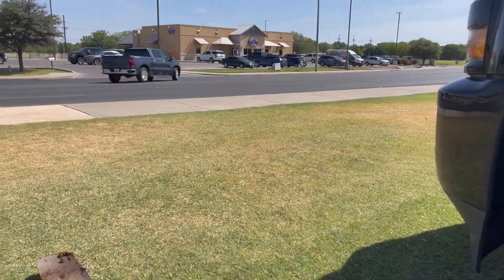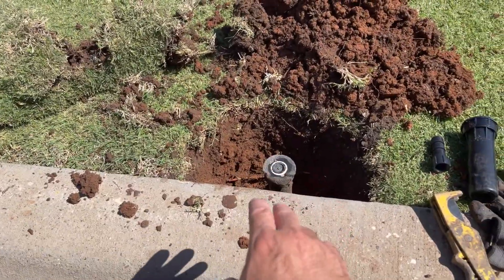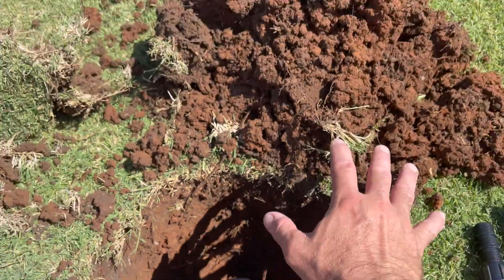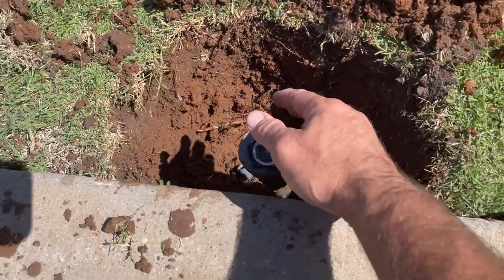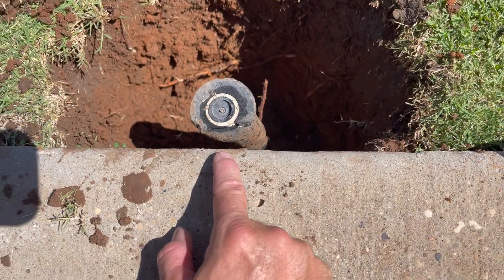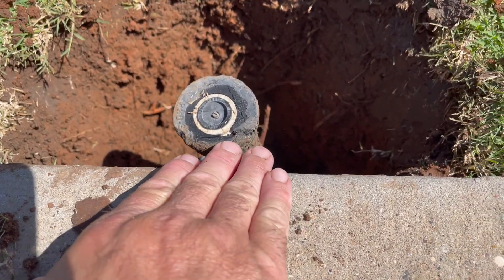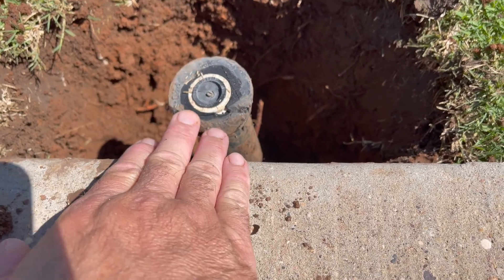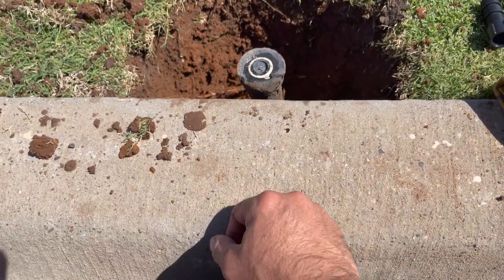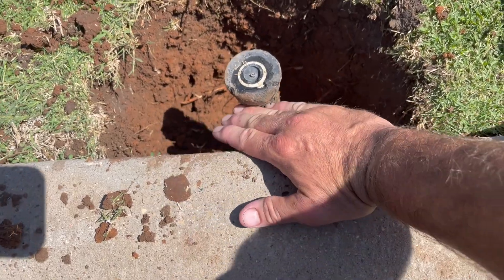Water is shooting out everywhere and it's really affecting this zone. This area right here is very dry and we're losing a lot of water and pressure. But the other thing is, if you're going to fix this, don't put all the dirt back and cram it up against the curb — the guy edging is going to hit this head, break it, cause a leak, and we're wasting water and not getting it on the grass. So when you do a repair, put the dirt behind it and even push it up a little bit.